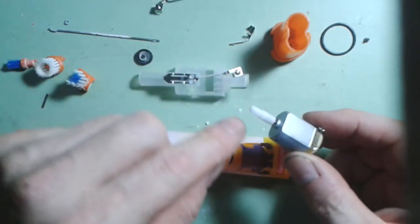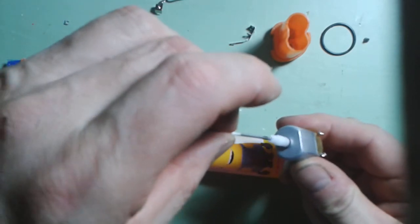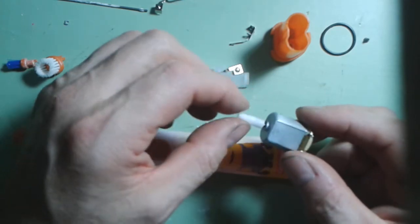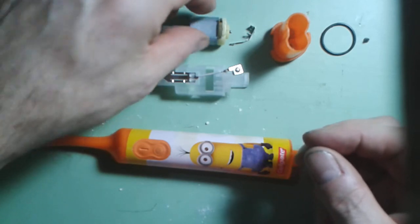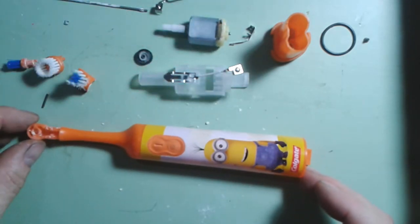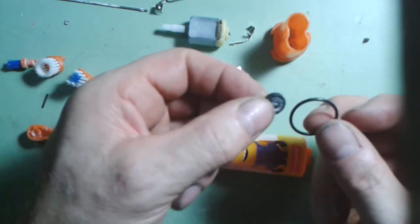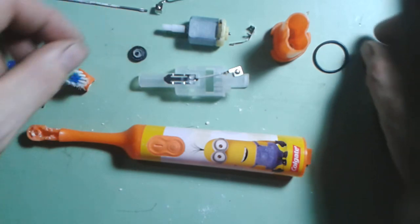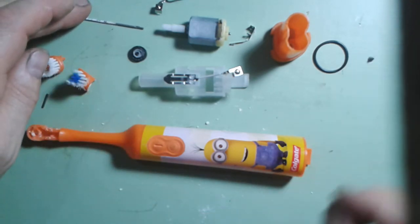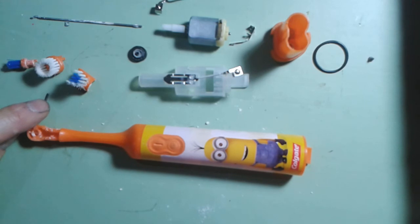The motor carriage piece is almost certainly another injection moulding but something more flexible like PVC. There's also another tiny injection moulding on top of the motor shaft — a force fit with a little funny shape on the end — and that's almost certainly something like nylon, either a compression casting or a very simple injection moulding. The metal items — the screw, the shaft, the little axle — haven't gone rusty at all, indicating they're probably made from stainless steel. You obviously wouldn't want rusty bits of metal appearing in your toothbrush. The pin in the head is probably also stainless steel.